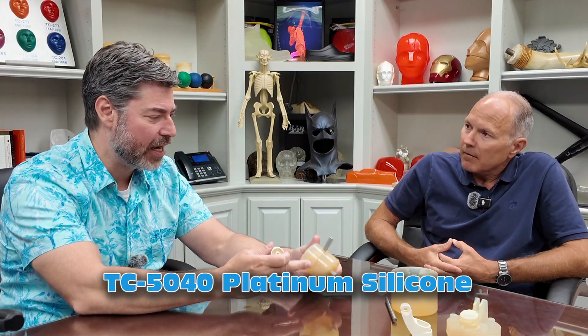As far as the tolerances — this looks like the 50-40? I believe it is, yes. So 50-40 silicone, which is a nice translucent platinum system. I should point out that if done in accordance with the right process, SLA parts can be molded with platinum silicone. That's one I had always done — molded SLA patterns with platinum. Did you seal them? Oh yeah, definitely painted, sealed, everything. But I have a fair amount of followers on YouTube who have run into all kinds of problems with that.